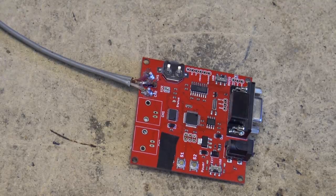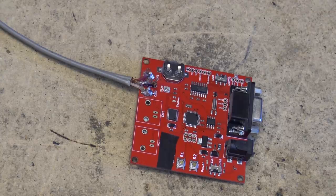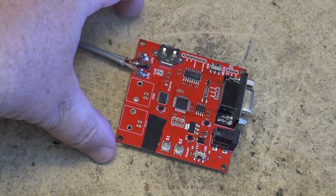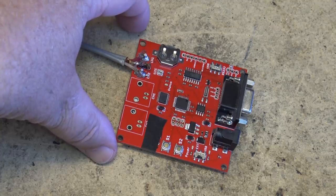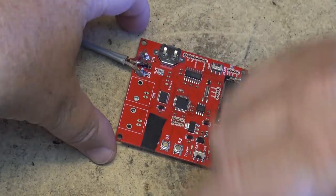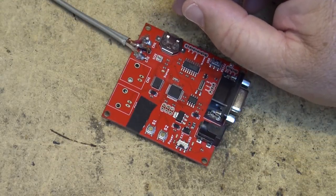And I'm sure there was no bad intentions on this scope that all the capacitors were replaced on. But one thing that they didn't do was they didn't check to see if there was any voltage coming out of the inputs on it. And, of course, neither did I until I hooked it up and my module was cooked. Then I put the meter on the X and Y input and found that there was 85 volts DC on one of the inputs. So I'm assuming that there's probably a capacitor that's leaking and presenting a high voltage on the input, and it cooked this. So we're going to try fixing it today.